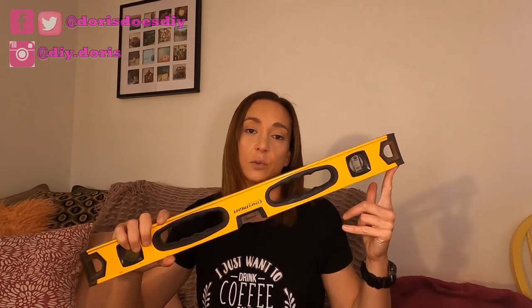Carrie said she wants to hang them on brick walls. You're gonna need to get into brick — a hammer drill with masonry drill bits. Don't forget I did that big video on what drill bits you need, I'll pop a card and drop it in the description box below. Also gonna need a tape measure and a pencil — this is a carpenter's pencil but you can use any pencil or even a pen. Gonna need a hammer, a spirit level, some wall plugs, some screws, and a screwdriver set with Phillips head screwdrivers. Stay tuned to find out what you need a chisel for.